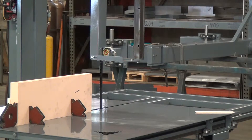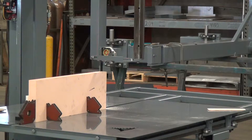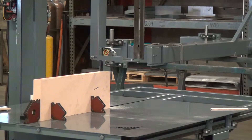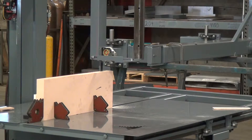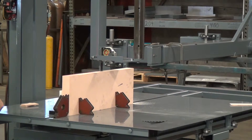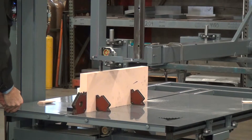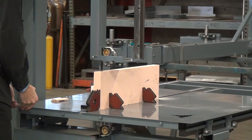Start the saw and I'll ease into it. Definitely cuts slower going through this material, but it's taking it just fine. I'll get a little more aggressive here. Cutting through this much material is better with a powered table drive — I've got some experience operating saws, but it's hard for me to maintain a constant speed and pressure, whereas a powered table drive does it automatically. But I think I've got the feel of it. Maybe a little bit of a warp in the blade weld, so we're getting a slight surge in the cut, but I don't believe it was impacting our quality at all.